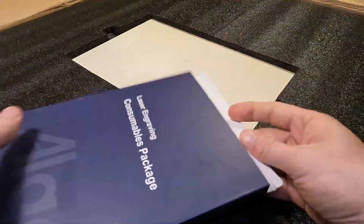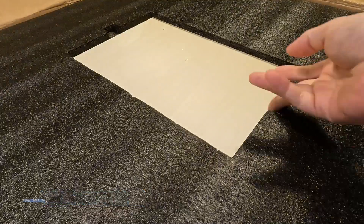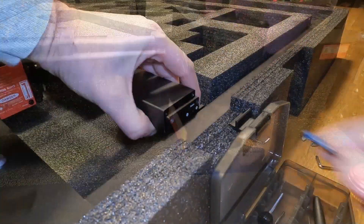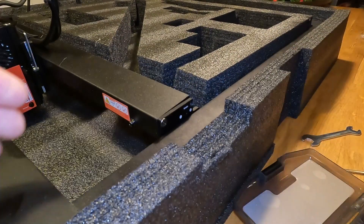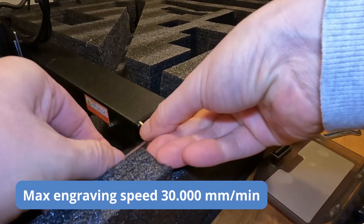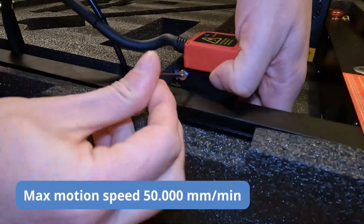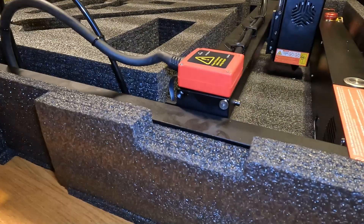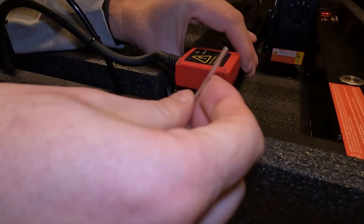As far as lasers go, the working area is 440 by 450 millimeters, but the overall size is 650 by 730 millimeters — it's a pretty large one. Optical laser power is 22 watts and overall power consumption is around 144 watts, depending on laser power used. Maximum engraving speed according to documentation is 30,000 millimeters per minute, and motion speed is 50,000 mm/min. Safety features include active power-out detection and protection, laser overexposure time limit which should prevent fire.